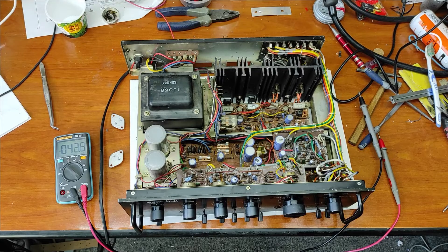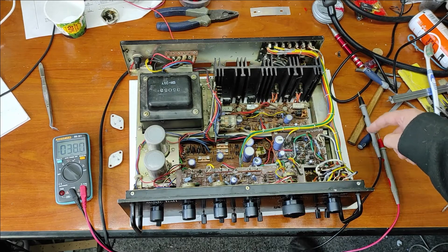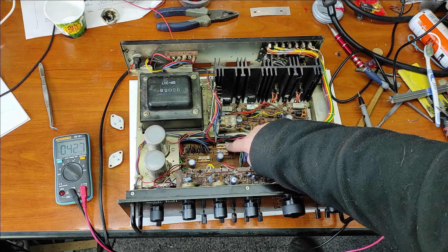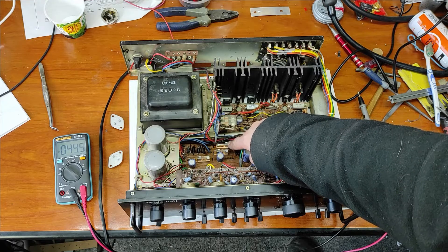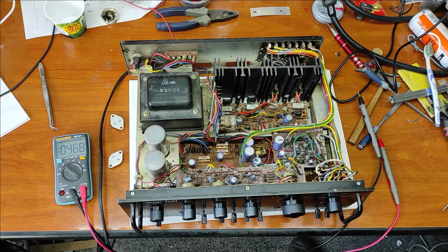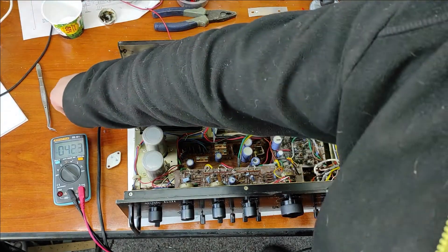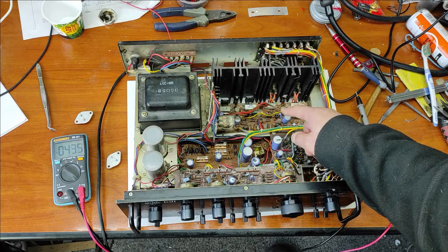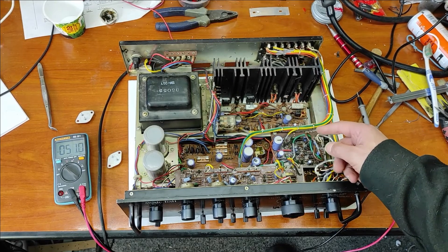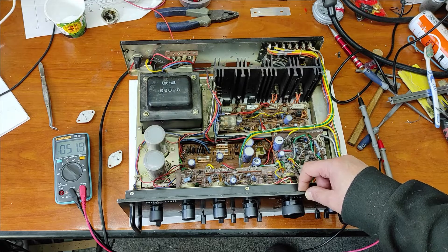Now here I am after a few days. I replaced all the bad transistors, I replaced the power resistors, and I replaced the socket for fuses, because before they had big fuses but it's small current so I decided to replace it with a small type. Instead of the original power transistors, I put substitute transistors just for a test, because I couldn't find the exact originals to buy. I ordered them from China and it will take a few months to arrive.